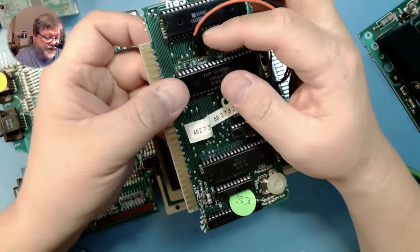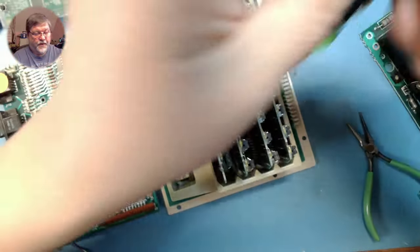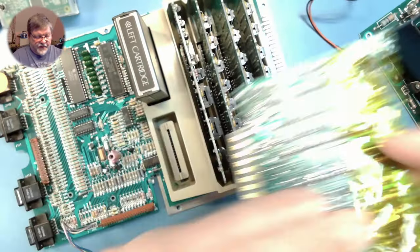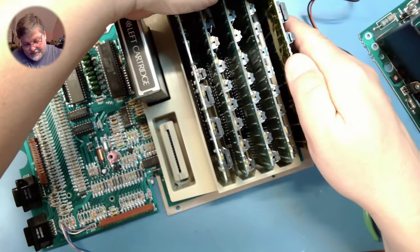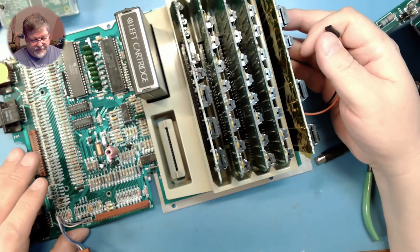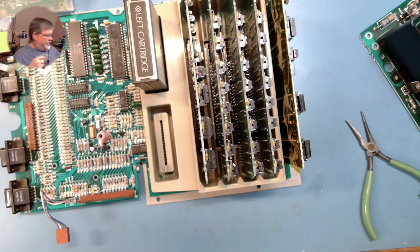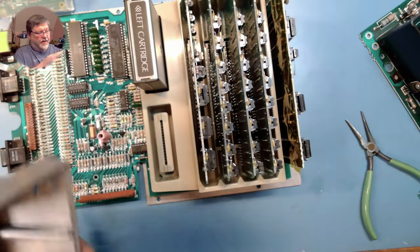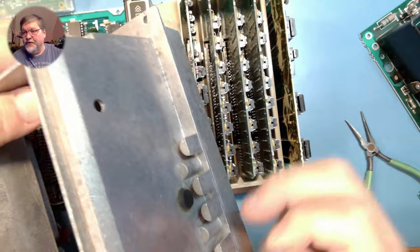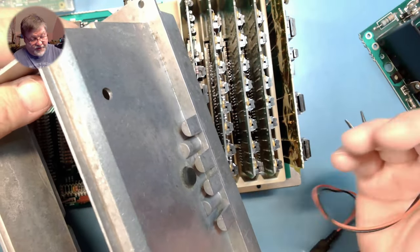The pins did have to be lifted a little bit so that it would clear the Antic chip. First, we slot the CPU board back into the 800, because with this shell you need to have a way to get the connector outside the shell. The shell on the 800 does have a hole here, pre-drilled in it — I don't know what that was originally for, but it comes in very handy here.